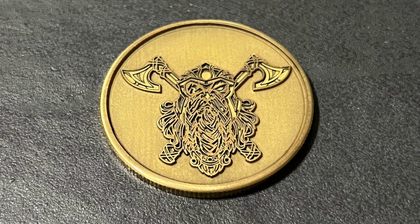The downside is you don't have the ability to have a dark background unless you're running really hot and really close line intervals for the entire engraving. I have in the past done an outline, like a trace, and then traced the whole image and just did the outline of the entire design and then put a circle around that and use that as a guide to engrave. That's something that you could do. Maybe that's something I could do a short video about in the future to help out with.